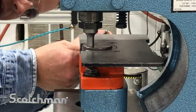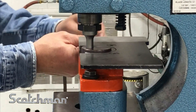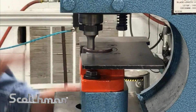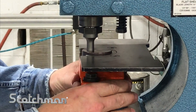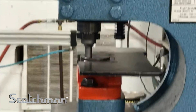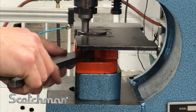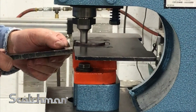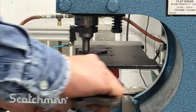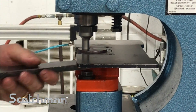We're going to go ahead and tighten our set screw for our die. Now our set screw is tight on our die, and our jam nut is tight on our punch ram for our punch. Tighten down the die holder itself. Your last adjustment — get it very tight.